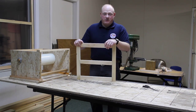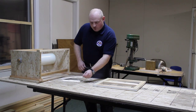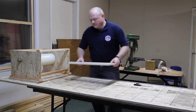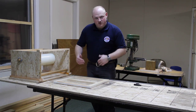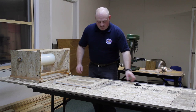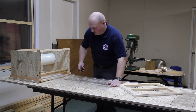In continuation of this lesson, now it's time to cut and apply the plastic. Our plastic is folded in half and it's 40 inches wide. So as long as your window is 40 inches wide or high, you only need to cut for one of the dimensions. We're going to cut basically six inches longer than your longest dimension. So if your window is 14 inches, you're going to cut about 20 inches of plastic. We've drawn lines on the table here in six inch increments to help judge where that is so you don't have to make precise measurements.